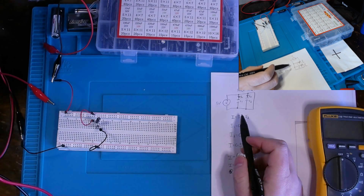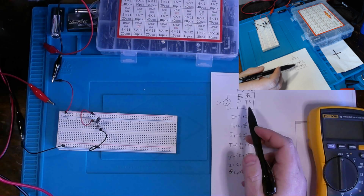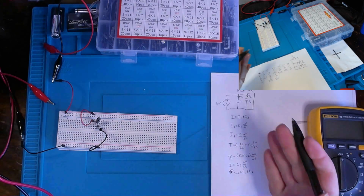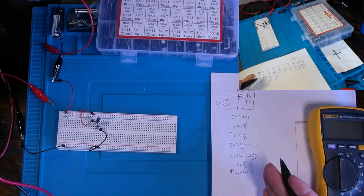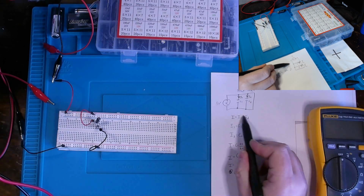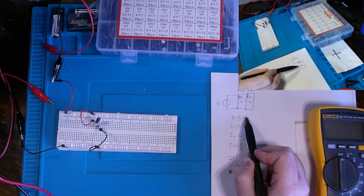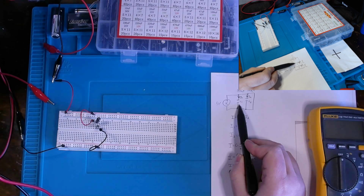And now, considering two capacitors that are connected in parallel, as both the capacitors are connected in parallel, the potential difference across both of the capacitors will be the same. Okay, now we apply Kirchhoff's current law in this case, and from the equation we would say that our total current would be the current I1 plus the current I2, going across capacitor 2 and I1 across capacitor 1.